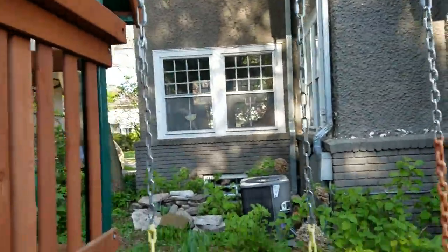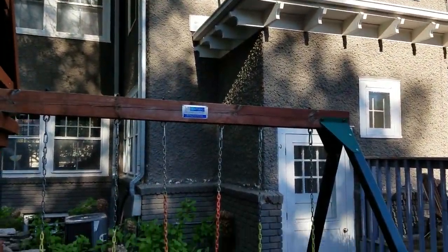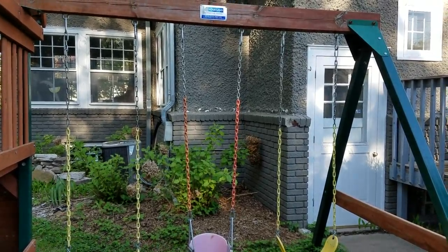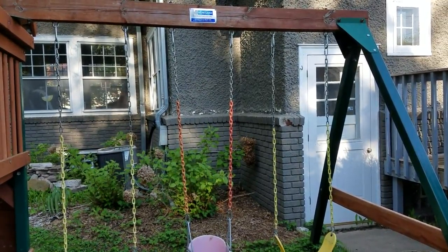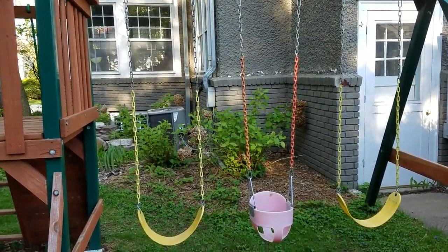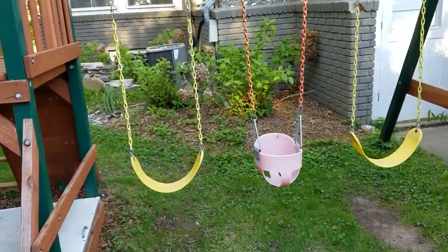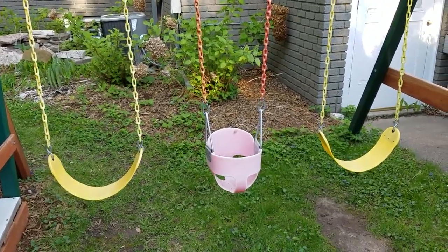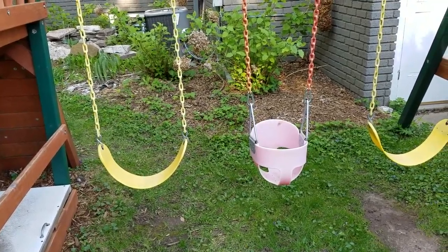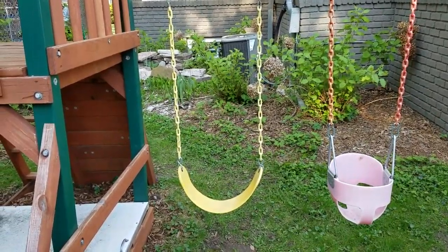This playset is going to be moved. In this back corner area, he is going to be putting in a pergola that can have screens put on it. We would need to dig four sonotubes and fill them so he can bolt onto them with 6x6 posts for his pergola. We'll get the exact placement and pour it ourselves. There's going to be a patio in this footprint — the pergola is 10 by 12, but with a foot on each side it'll be a 12 by 14 patio.